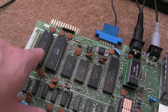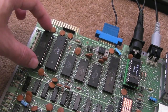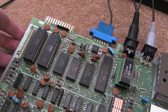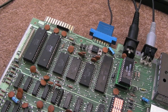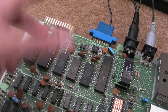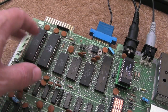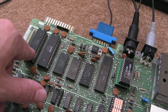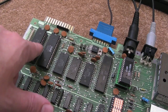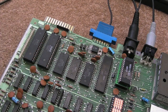As a side note, while we're on the C64 — this is the one where I think there were two CIAs missing. It was around the time I ordered a bunch of CIA chips and got some from China. One of the ones from China was in one of the positions, and while I was testing everything was fine, then I switched it off and on and there was no cursor. I thought it was a CIA problem. I reseated the chip, same result every time — no cursor, floppy drive wasn't working either. I swapped it for another chip I got from Germany and that worked fine. I retested the China one in another machine — it still doesn't work. So one of those China-sourced chips has not lasted very long at all, which is strange.